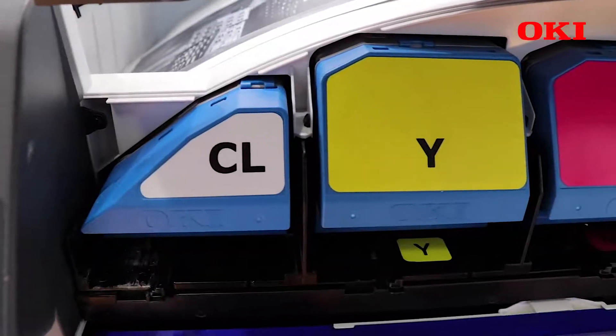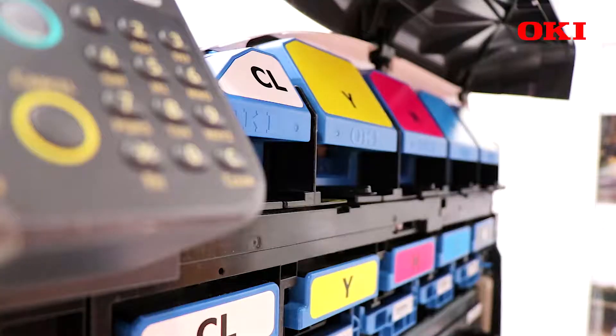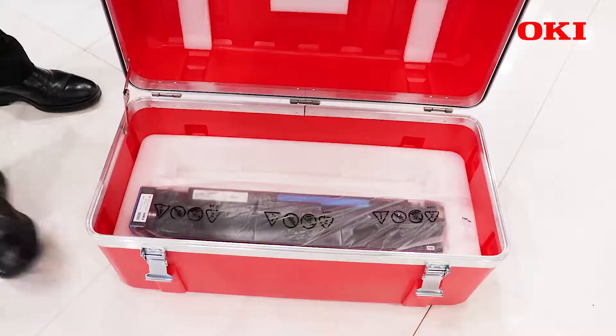You can use it with clear over, white under, white over, and just CMYK. All the consumables in these three printers are front loading, so you can change them over in about 2 to 3 minutes with very minimal training. It's all done by the operator, not by an engineer who needs to visit.